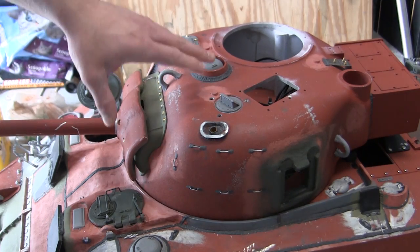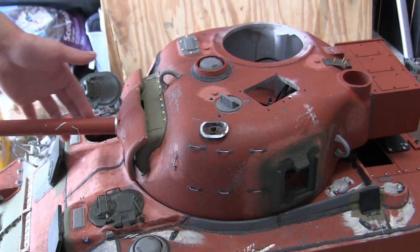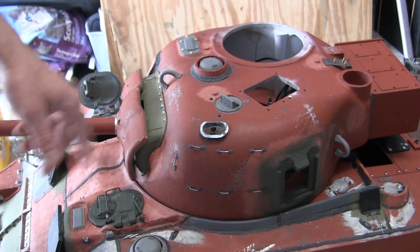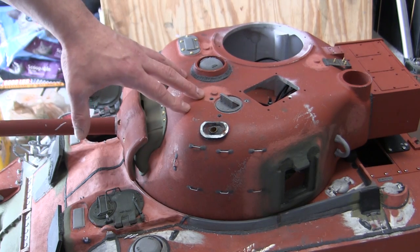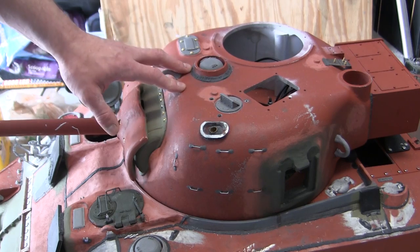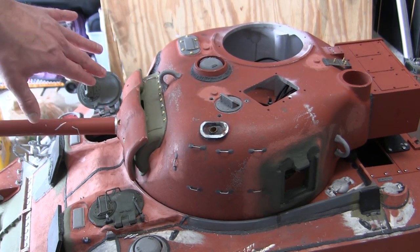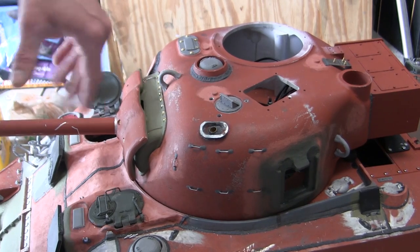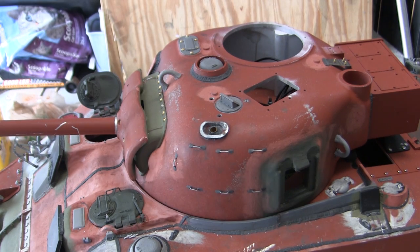And here goes the turret now mounted to the body of the model. All of the electronical connections for the main gun elevation as well as the barrel recoil have all been plugged into their appropriate locations. In addition to doing this, I also went ahead and fine-tuned the turret rotation by removing some material in some spots, thus freeing up the surfaces even more, allowing for the turret to spin a lot more smoothly. I'm going to go ahead and first test the turret rotation.